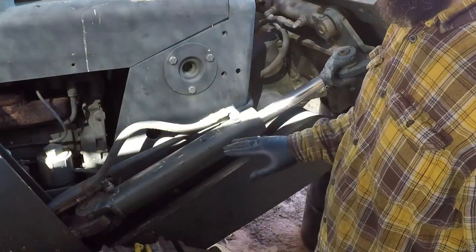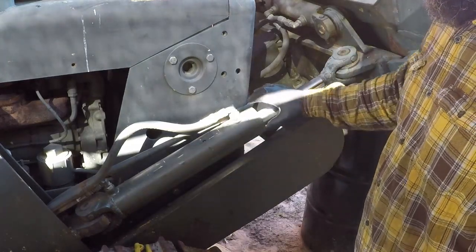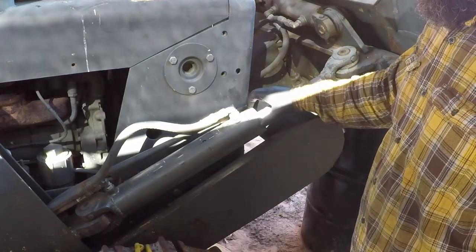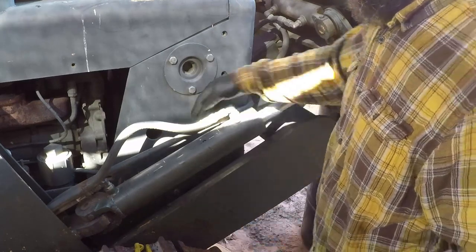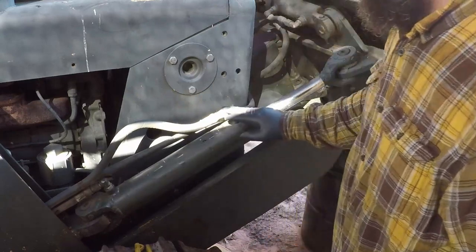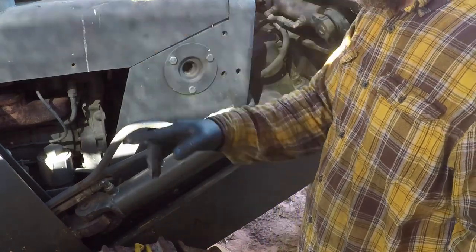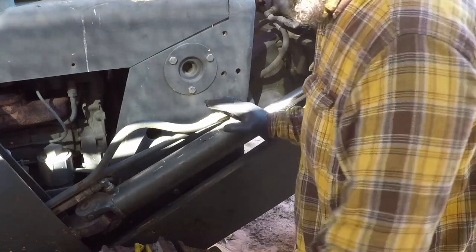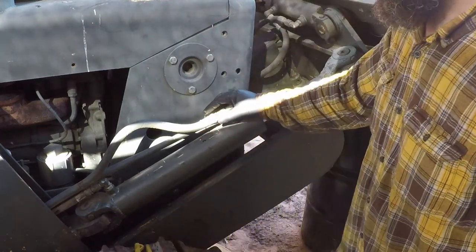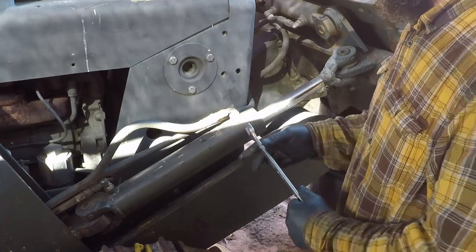Very important tip, before you do similar work, wash your machine. This way you prevent contaminants from getting inside and you also stay clean. I'm going to loosen these hoses and tie them up higher than the hydraulic reservoir to minimize the leak. I will also protect them because it's probably going to take me a week to find the right seals for these cylinders.